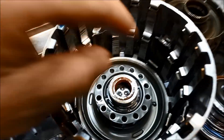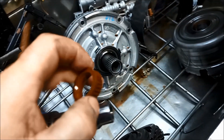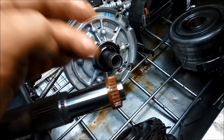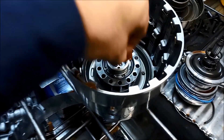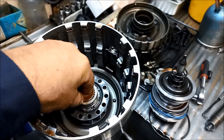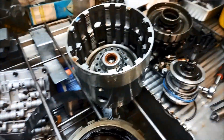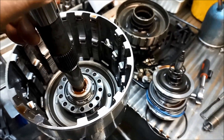Now, there's a little thing called a lube seal here. You can see that seal — it runs on your output shaft, it actually seals here like this. You can see that one's flopped right out. There's no tension on that rubber at all. Even if I put that in at the spline section, which will push it in and sort of tighten it up a little bit — you can see it's really floppy loose.